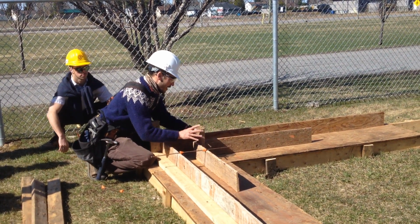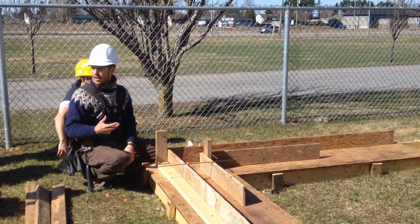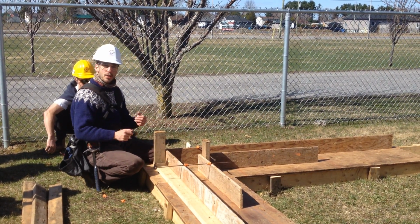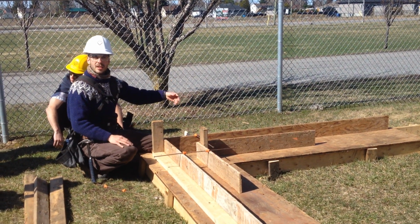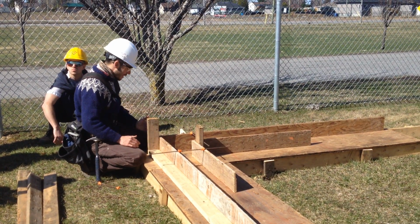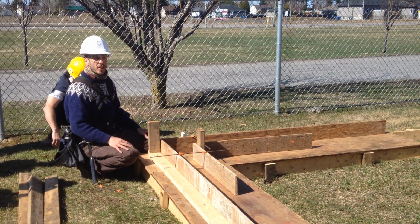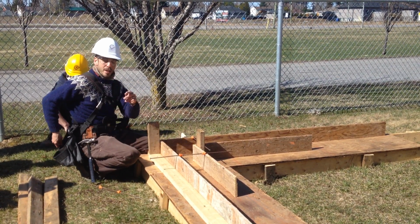Okay? So, because we're learning and because we are going to work fast and under pressure, we can make mistakes. So it is important that you grab some small material like this and do an initial layout, because past this, it's standardized. The rods are on center. The first rods are not the same distance from the corner as the first two, because of a weaker, stronger corner pattern to start. Okay? So once you've located that, then you can start doing a layout.